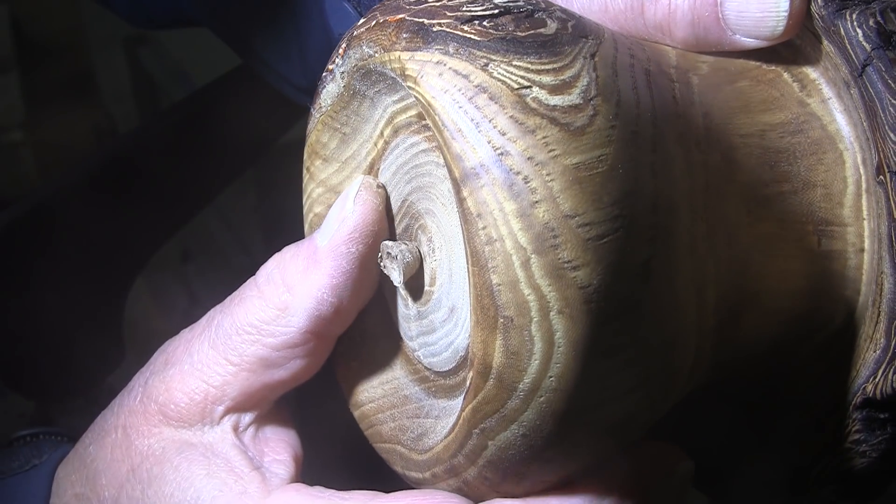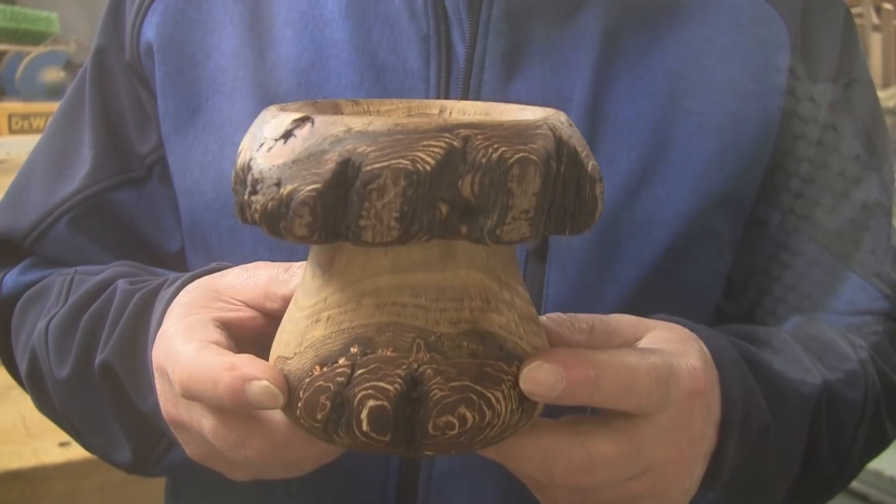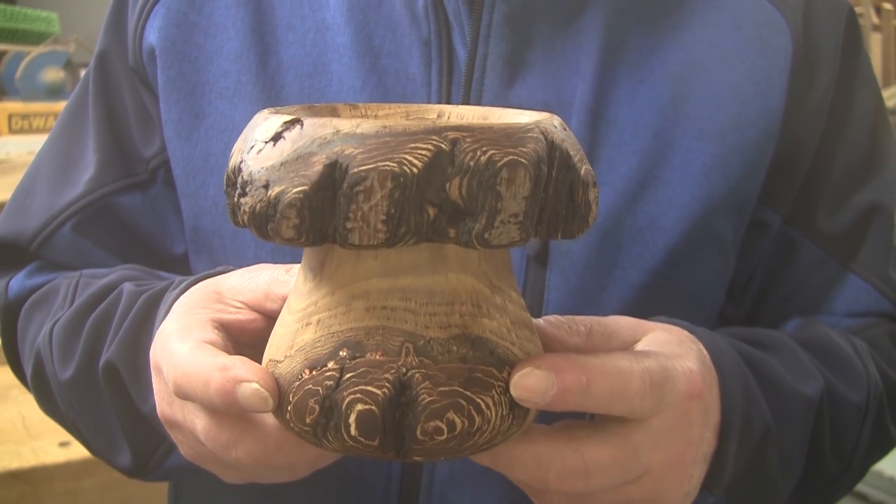This is end grain and it tends to break away when you least expect it. Now I'm going to turn the speed down to 200 RPM. I'm going to apply the bevel of the gouge against the bottom of the bowl — right hand on the gouge, left hand on the switch, pressure towards the headstock — and when that little nub stops turning we'll know we're through. Then I'll just take this over to the workbench, sand it up, sign it, get it finished. Well there we have it — one white oak mushroom bowl in the books.